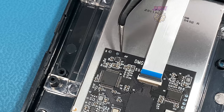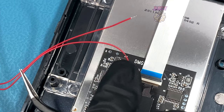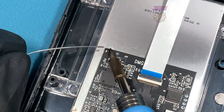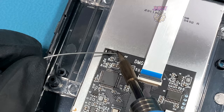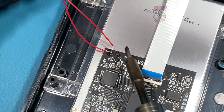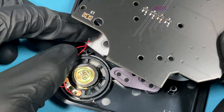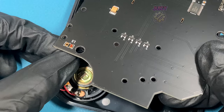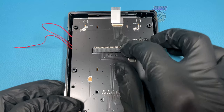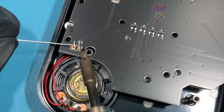Moving over to the board itself, there are two points here — this one is the ground and this one is the AV out. I'm going to tin these in preparation for inserting the new wires. I've marked one wire with a black marker, although I'd recommend using two different colours if available. With the pads tinned, I'm connecting the ground wire with the black stripe to the ground pad, and the solid wire to the AV pad. I'll then feed the speaker wires through the speaker pad and place the board into the shell, attaching the speaker wires to the speaker pads by applying solder.